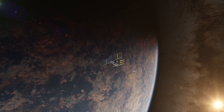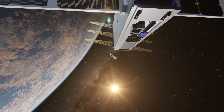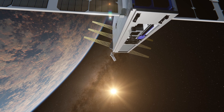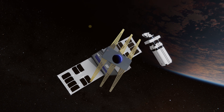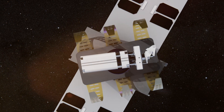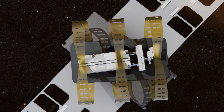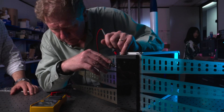We can accomplish a lot of that for some tasks that don't require a lot of force with something that's literally just a circuit board. The circuit board itself commands a shape and then becomes that shape. It's made from the same materials as ordinary flex circuits, but has a shape memory alloy wire laced through it, and as it heats up, it causes a rather dramatic shape change.